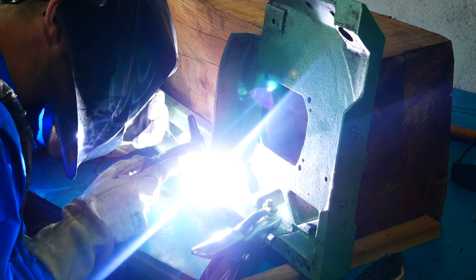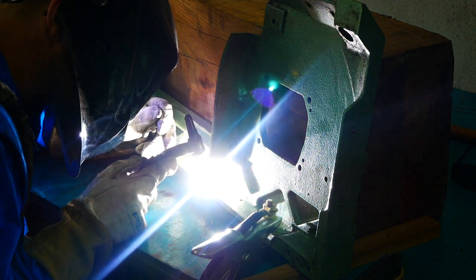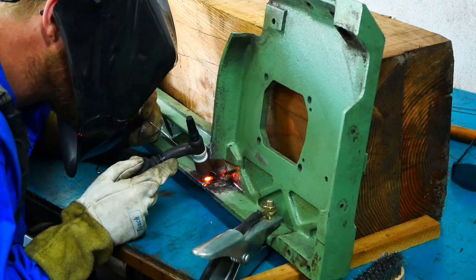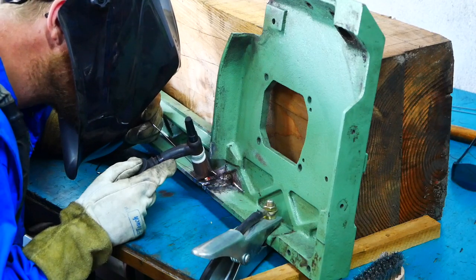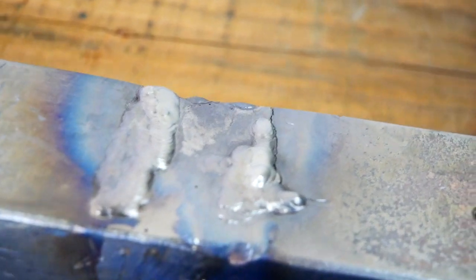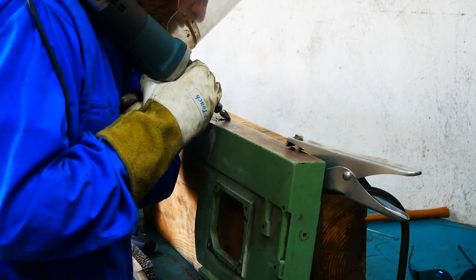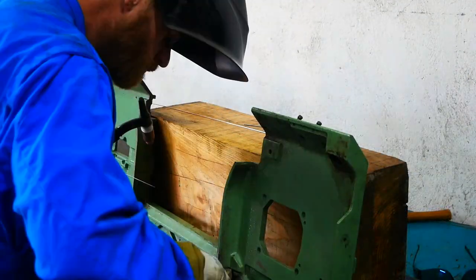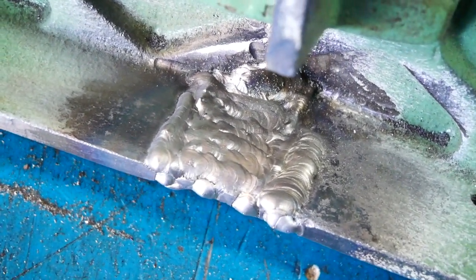It's not the best. Some say the chrome can be a problem because the chrome will make chromium carbides, and those are quite hard and brittle. But with some preheat, small welds, and peening in between, it does work. I had one crack at one end, so it was time for some grinding and re-welding it — but then it worked out fine. It's not the most beautiful looking weld, but it is without any cracks.